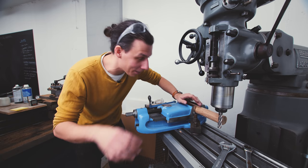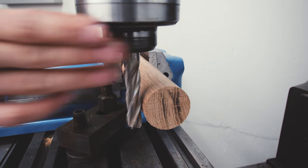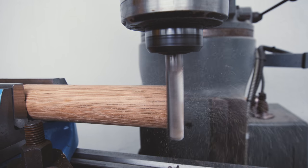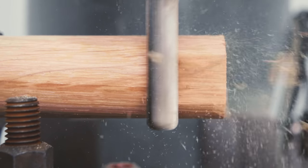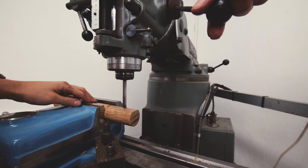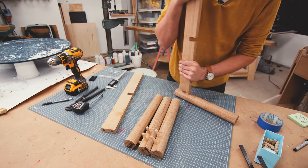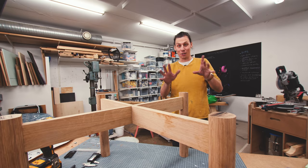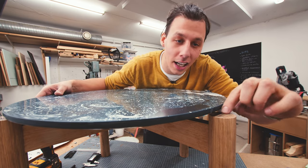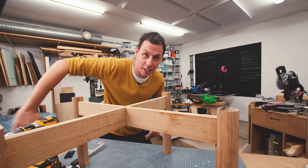We're back at my Bridgeport milling machine. I've got everything set up — the table leg is securely clamped in the vise, and I've got a big 16mm cutter in here. The goal is to make a nice flat spot on the top of the leg where the cross can meet up against. There's just one more thing left to do: right now the tabletop won't fit on here because the top of the leg will interfere with the tabletop — and that's intentional, because I want the top of the leg to have a chamfer that will hug the chamfer on the underside of the tabletop.